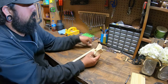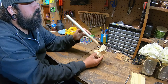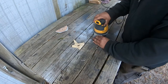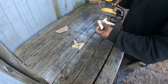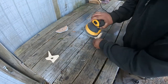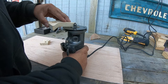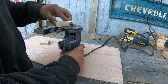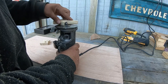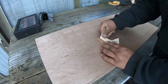That is much better. So no longer going with the half-inch — we're going three-quarter now, but it's all right, I like adjusting on the fly. Next I sanded each piece to 220 to get them nice and smooth. After sanding I took my palm router with a round-over bit and rounded over the edges just to give it a smoother profile, then took some 220 sandpaper and smoothed up the edges even more.